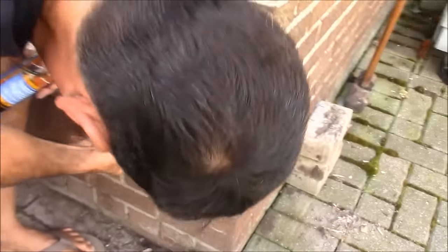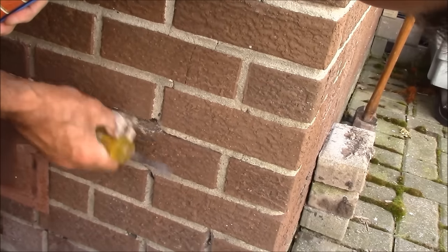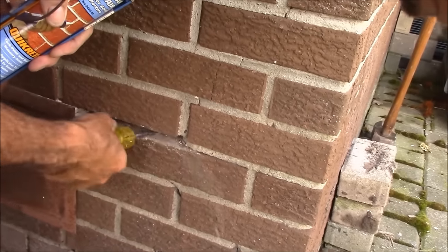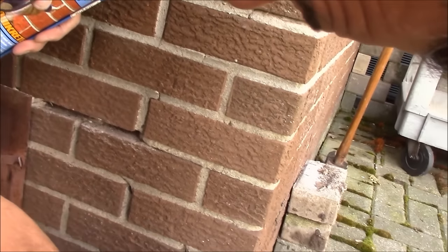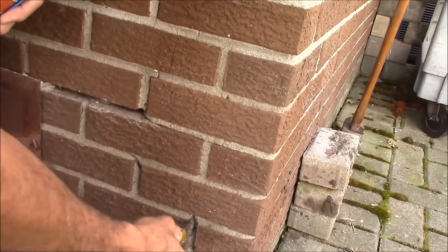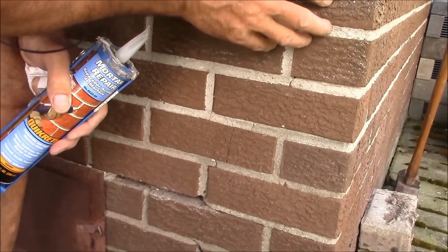Here we have some mortar that is actually literally falling out. You can see how easy it is. So I drag out all the easy mortar, clean it up, I identify all the holes where I'm going to be working. I'm going to leave these open — even though I'm sitting on the footing, they still might be aiding drainage because there is another structure underneath these bricks.